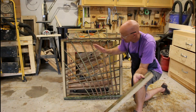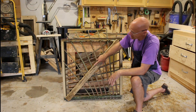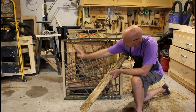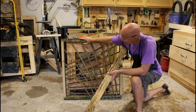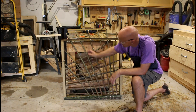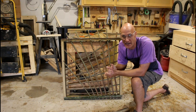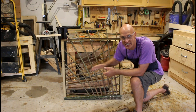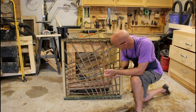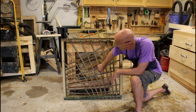Normally on a gate, in order to prevent it from sagging, you need to have a crossmember that goes from corner to corner so that the hinge side supports the weight of the gate hanging down. By doing it with these pieces of willow and screwing them in, I think I've got enough support where I don't need that cross brace. If over time it does start to sag, I can always put one in and readjust it. But I think I'm going to leave it like this for now and hope that the willow is going to be strong enough to support the gate.